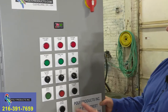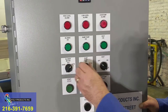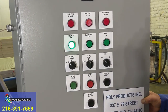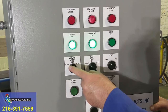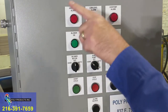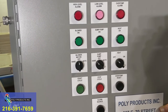The three main components on this system are the blower for the evaporator, the feed pump for the evaporator (labeled here as sump pump), and the heater. Under normal operation, we would set each of these to auto and on and hit cycle start. But if you're testing, you can leave everything else off and maybe just test the blower by putting it to hand and letting it run. You can also do the same with the sump pump. Note that if you turn the blower off, the pump also goes off. The pump is interlocked with the blower because we need the cooling effect of the blower to cool the solution when it enters the evaporator. The temperature could be so high that it could damage the plastic of the evaporator if the blower is not on, so we don't let you turn the pump on without the blower being on.